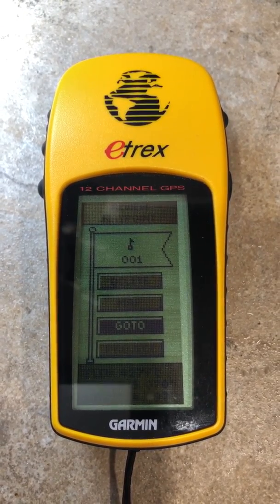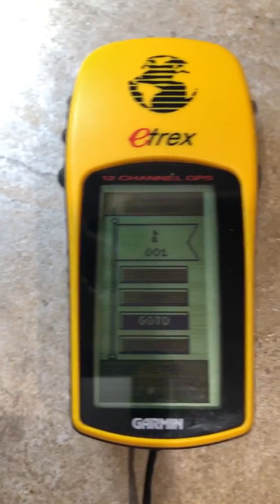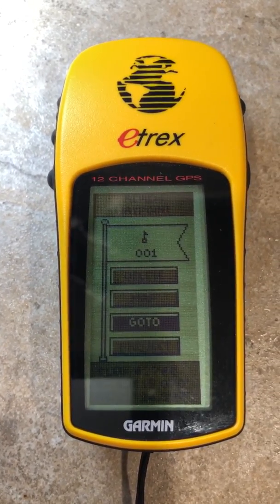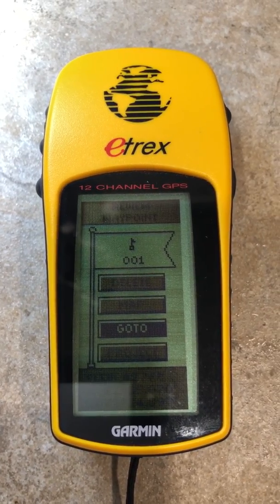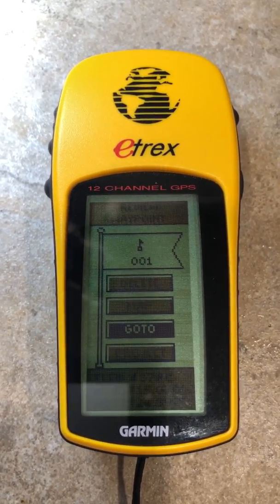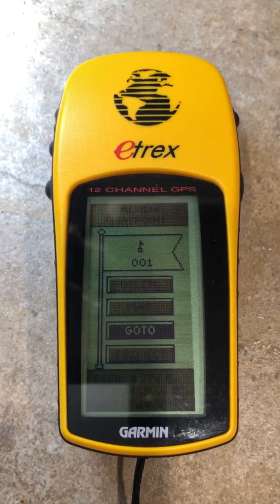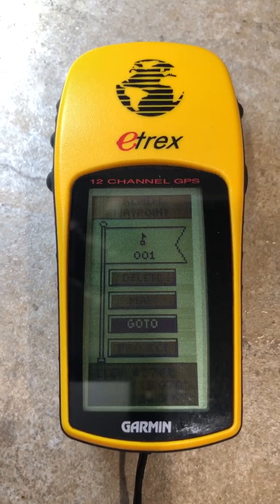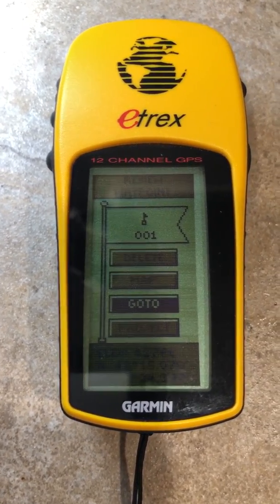If you are faced with your own unique device, I would try the same thing: get two devices, work with one for parts and a second as a known good unit, and try to make the original work. If not, you're left with a chip-off — and it was successful in this case. So good luck and good data recovery, everyone. We'll see you soon.